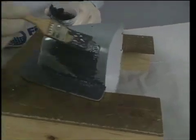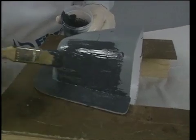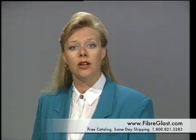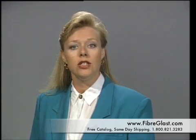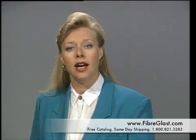The process will be exactly the same: first applying two layers of surface coat and allowing each to dry before continuing, then epoxy putty applied to the corners and edges, a resin base coat, and laying up four layers of the lightweight 2 ounce cloth and eight layers of 6 ounce cloth. Again, the lip will be trimmed in about 30 minutes, just as soon as it is firm enough to be trimmed but still soft enough to be done with the knife.